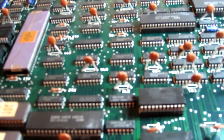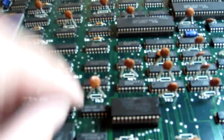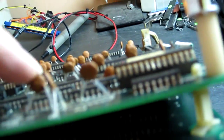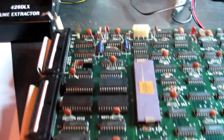And one thing I was wondering about while looking at this PCB and straightening out the caps is, why did you put the ceramic caps on big long legs like this? I'm not sure why, that's not a particularly common thing on video game PCBs. I mean, fortunately it's got long legs here to give it clearance so that they wouldn't interfere with the table. But a few of these were bent over from when they were wrapped up, so I'm just straightening them all out, making sure nothing's short-circuiting. There's absolutely loads of these on long legs.